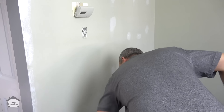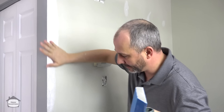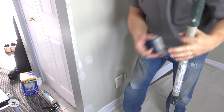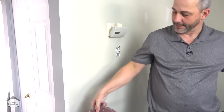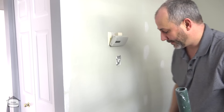Because we did a little extra work on this corner, we're going to use the hand test — just feel for any ridges, you might not see them. Outside corners can be a little picky because they usually have that curve and the Radius 360, even with a sanding sponge on it, sometimes doesn't do a great job in there. Keep that handy to double-check. Now we're ready to go — time for the first coat.